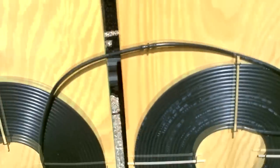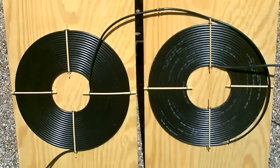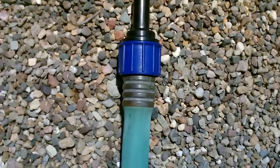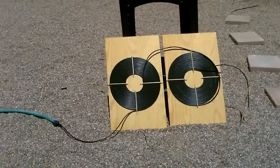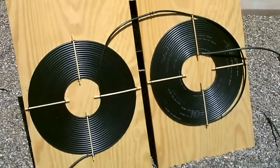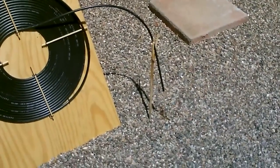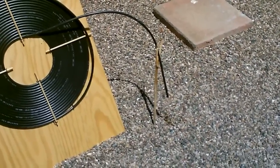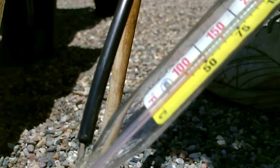The whole thing is completely dry still, which is pretty cool. Just got the two spirals right now, but you can add as many as you want. Those are two 50-foot quarter-inch black poly spirals hooked to the garden hose. Let me check the temps now — it's been running for like five minutes and I'm getting about 125 or 130 consistently.